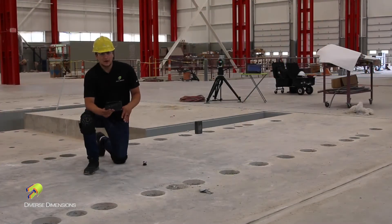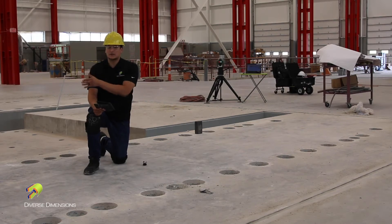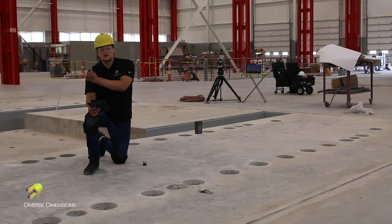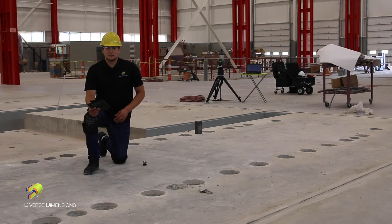I'm set up here and Betts is looking for a point on either side for both the master and the slave side — a point every meter. It's very helpful to have a DRO so I can see every thousand millimeters where to place my SMR for a point. So let's continue doing this.